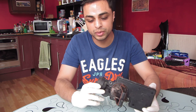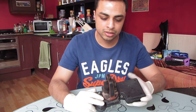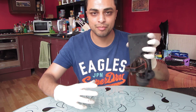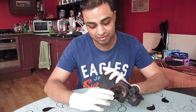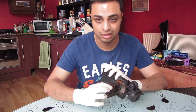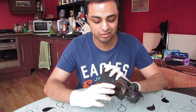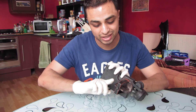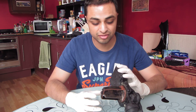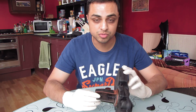We'll start off with what would be the worst case scenario — a DISA that's about to imminently fail. The worst case scenario would be a DISA flap that's flapping around freely and the shaft itself doesn't look perfectly straight — it's a little wobbly and this end piece here looks a little loose. If the flap looks wobbly, it's not perfectly straight, and this end piece looks loose, that DISA is about to fail and these plastic parts are going to fly off into your engine and cause major engine damage.